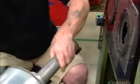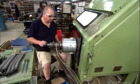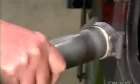The main tube of the bike frame now undergoes a process called shot blasting. An operator turns a crank to make the tube revolve in an enclosed chamber as nozzles blow fine grit at the hinge joint. This cleans up some of the rough patches. A little manual filing then smooths the area around the hinge.